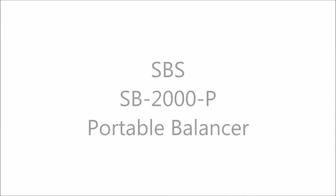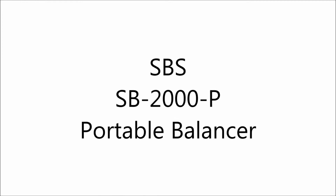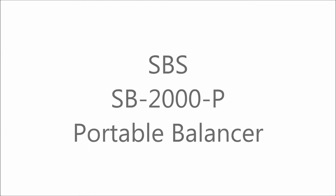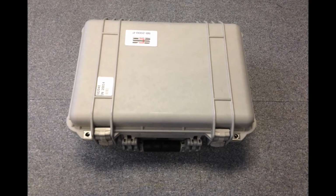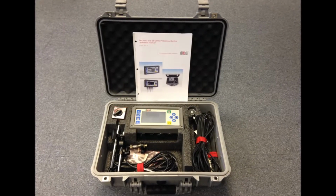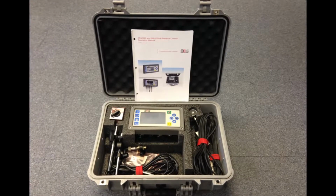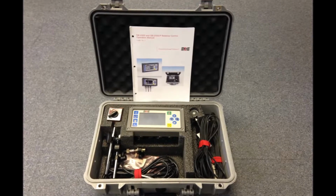The SBS Schmidt balance systems SB-2000 and SB-2000-P are a range of dual-plane manual balancing systems designed for accurate dynamic balancing of rotating machinery. In this video, SBS demonstrate the SB-2000-P, the portable version of the unit. The SB-2000-P is a dedicated two-plane balancer supplied with everything that is required to carry out on-site balancing, including the control unit, two vibration sensors, photoelectric speed sensor and tough ABS carry case.